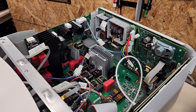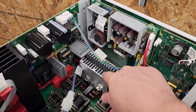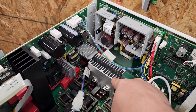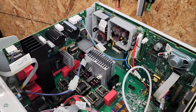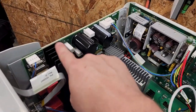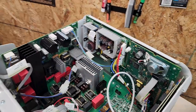The rest of these were just fine. Now, whenever you touch heat sinks in a unit, make sure it's unplugged - because I have actually seen units that are shorted or hot with mains voltage, and I have been lit by just touching them. Come to find out it was shorted to mains and I got zapped. So guys, if you're going to do some temperature checks, make sure the device is unplugged.